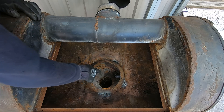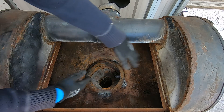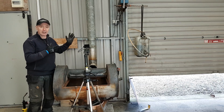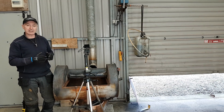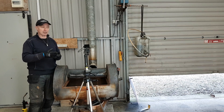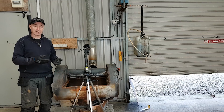How this works: I have a waste oil burner down inside here. The flames come up and lap the inside surface of all that space — all of this metal gets red hot. Even the pipe is single wall flue, and the idea is that whatever heat is in the flue way going up the chimney, some of that will radiate into the space as well. It works brilliantly. It's only single wall tin and it radiates heat like nobody's business. You can't keep heat in this shed, so the only way to sort that out is to overcome the heat loss by making more heat than I lose.